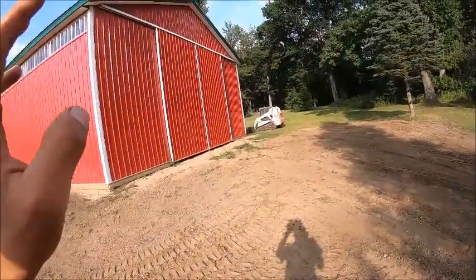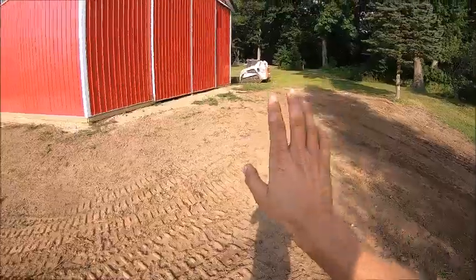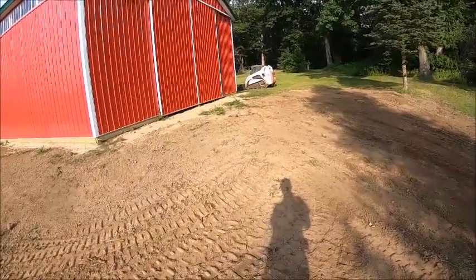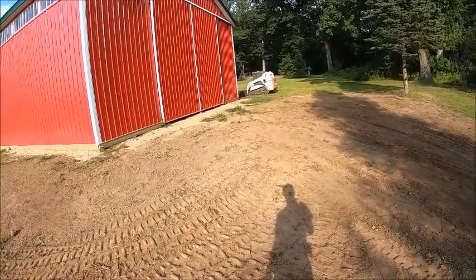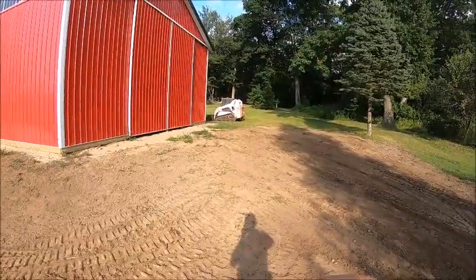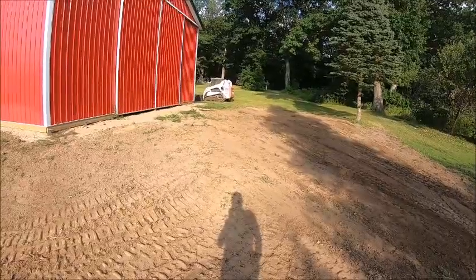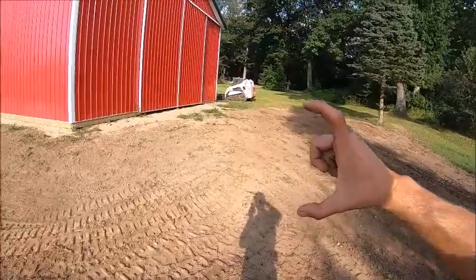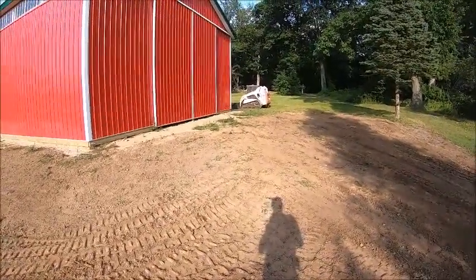The biggest beef I've got with that skid loader, that Bobcat, is that the curl back on the bucket is atrocious. Normally you want to carry your load as low as possible. If you set the bucket all the way down and put the butt plates up against the frame of the skid steer, like you should when carrying that kind of weight, the dirt just spills out the front of the bucket because it's only this far off the ground. I'm basically sitting level.